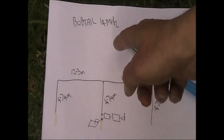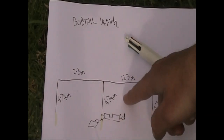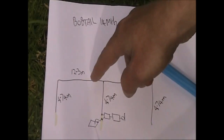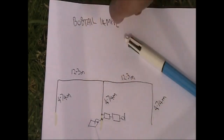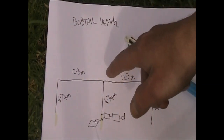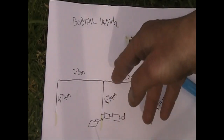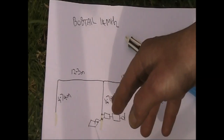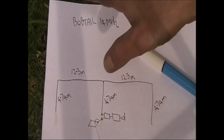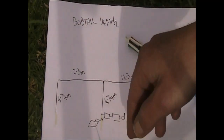Now, the radiation pattern will change somewhat. I had a look on the modeling software. On 10 megahertz, which is another good DX band, the radiation pattern is fairly similar to 14 megahertz. You've still got the main lobes broadside to the horizontal bit, but the nulls are not quite as severe. If you were to go up to 18 and 21 megahertz, then the pattern breaks up. Instead of having dominant lobes coming off broadside where it's a narrow figure eight, it's more like a clover leaf.